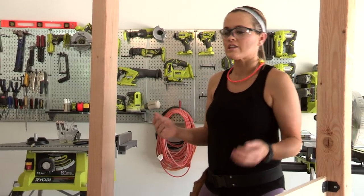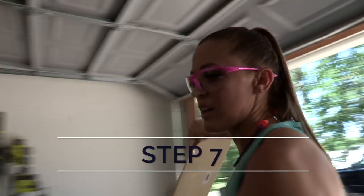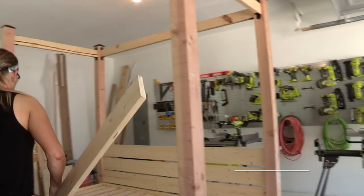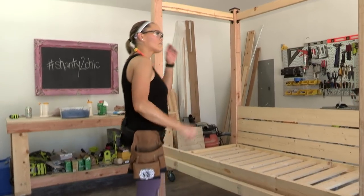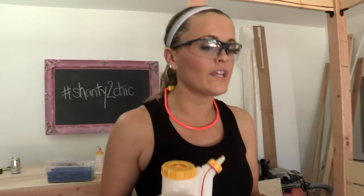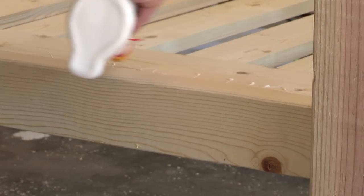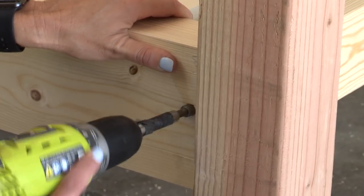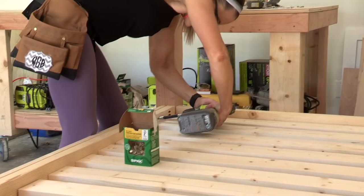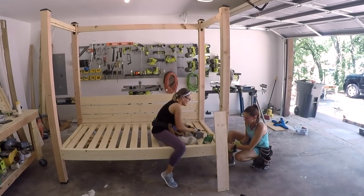Back slats are finished. Now we're going to attach the front and back aprons using wood glue and some decorative hex screws. We're adding wood glue on the front of the runner, putting the apron in front of it, then coming in from the inside and driving shorter screws to hold everything nice and tight. We'll link those decorative screws in the description box. Then we're attaching the side aprons the exact same way.